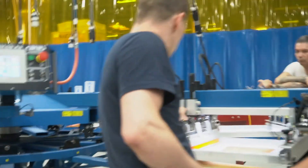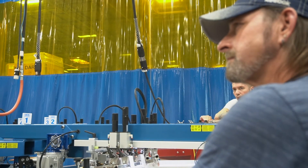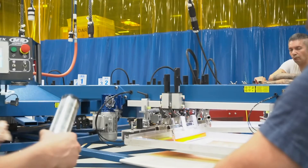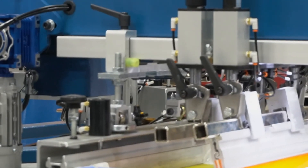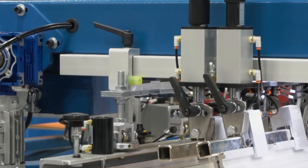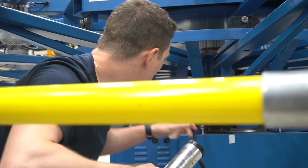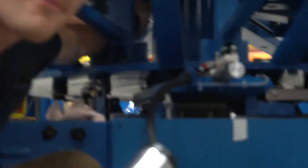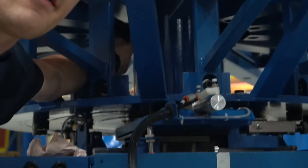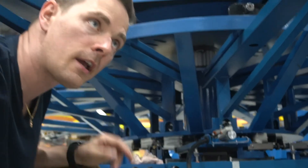Next step — same grease, grease fittings. Every single print head has a grease fitting. If this is a 10-color machine, you have 10 grease fittings. Every two weeks, put about two pumps of grease into each fitting. Very important: the center shaft has two grease fittings — one on top, one on the bottom. So that's 10 on top for the printing heads plus two for the center shaft — 12 total so far.